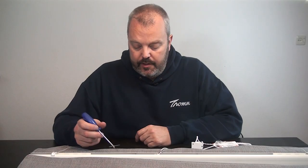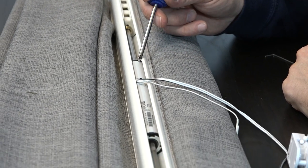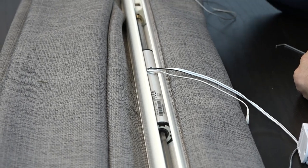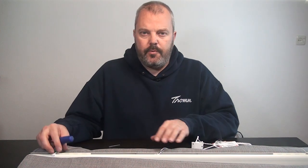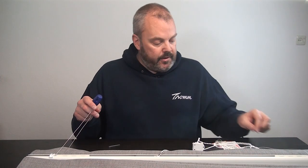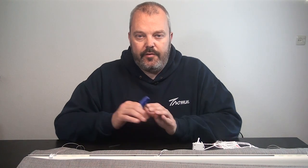I've done one side and I'll do exactly the same thing on the other side. The shaft is pushed all the way in so the adapter is inside the motor. I've placed the ring close to the rolling mechanism, tightened it, and tightened the rolling mechanism. One important thing to keep in mind: the strings must be kept at the same length to ensure the blind rolls up evenly and stays level once installed. A difference in string length will cause it to be out of line.